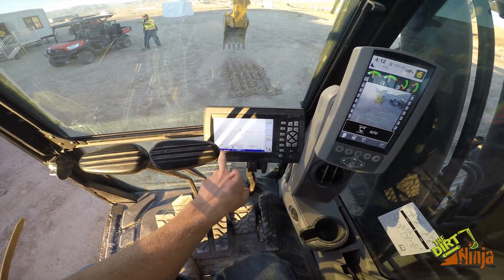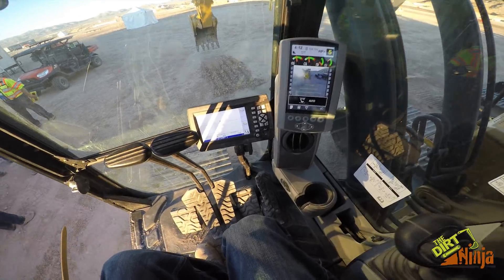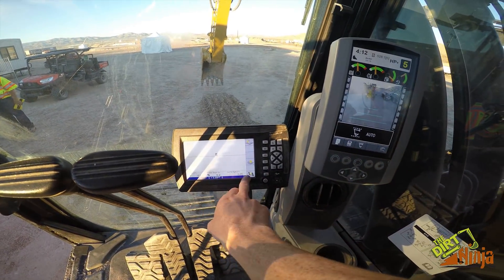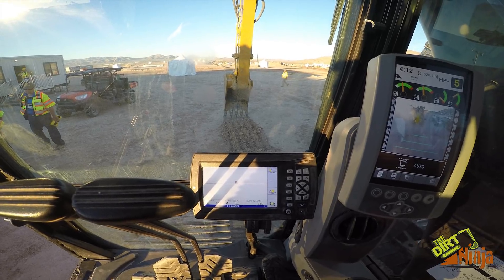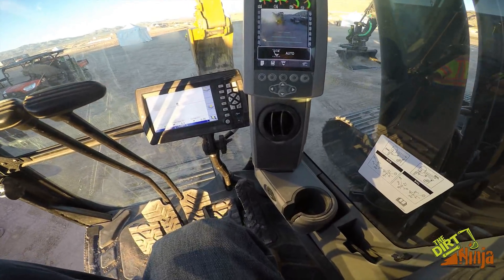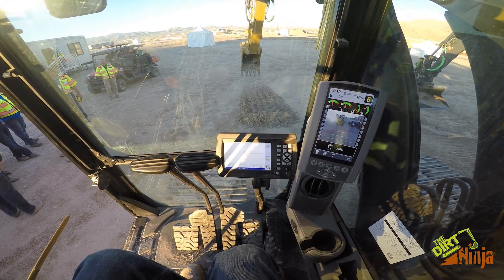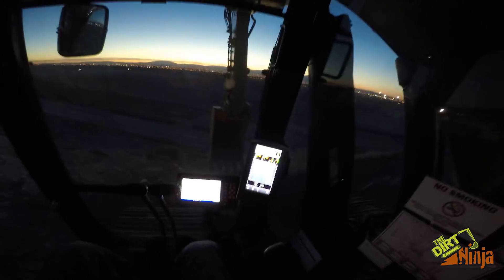The next day here during the day I've got a level profile set up on the Trimble system. I'll show you kind of how it moves. If I just get down to grade — it also has dig protection — so right now if I push this down to lower my boom it won't go any lower; it's not going to let me go below grade, which is pretty neat. So again, just watch the depth indicators as I pull the bucket back — see how it's just keeping it level. Our existing grade goes up so that's why I'm cutting now.